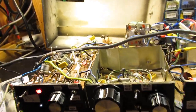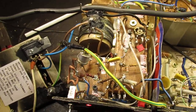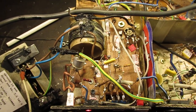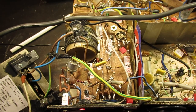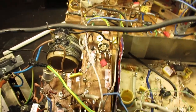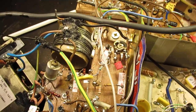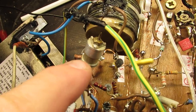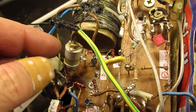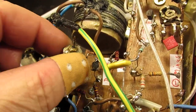So, I told that there was a very important capacitor here. That's here. Let's see what it can bring when we tune it a little bit. That means, in fact, tuning the antenna coil to the best frequency to receive certain radio stations on certain frequencies. So now it weakens. That means there is less capacitance here. I turn that capacitor out, and now I turn that capacitor in.